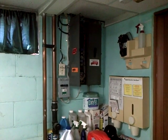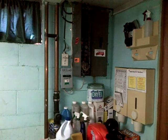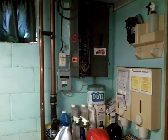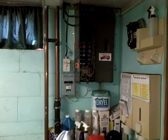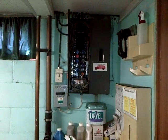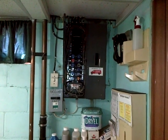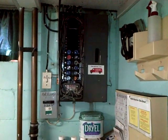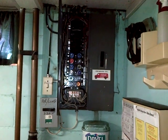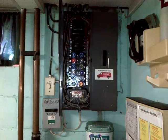Just preparing to change this older 100-amp fuse panel, which is probably the original panel in this home from the early 60s. It's a 100-amp older CEB vertical knife blade main disconnect, which can have problems inside. We don't have that open right now because I'd have to open that disconnect — turn off the power — to get a bird's eye view inside the cover of the main section. I don't want to shut them off right now.